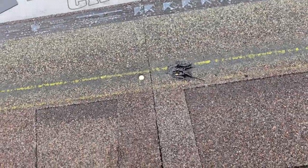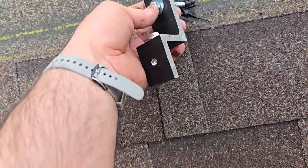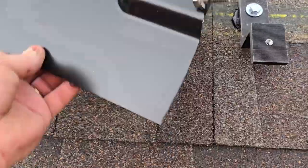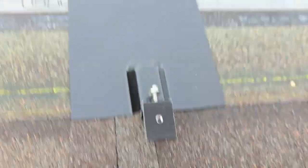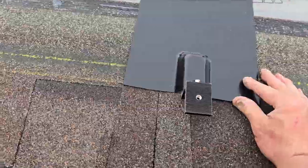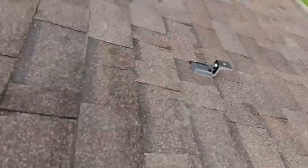A little bit of roof tar right below my four-foot mark — that's four feet. All trusses are four feet or two feet on center; I'm going four feet on these. Put it right below my mount, around the yellow line, torque it down. This is the flashing that goes above it — just goes here like this. The bolt goes through into the lag in the back, then slowly drive it in, and they'll roof over the top of it.